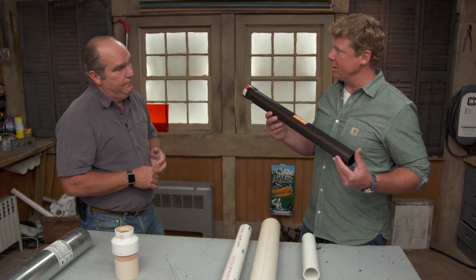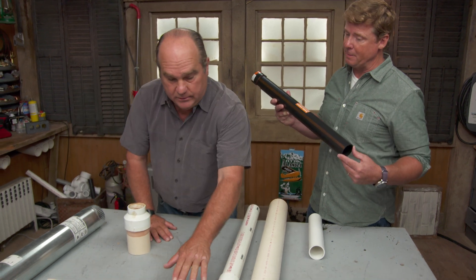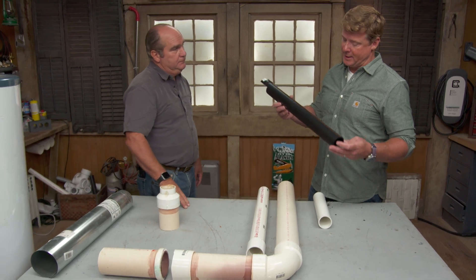So the lesson is, we're looking for this for new installation. If you see in your basement as a homeowner that the pipe is fully discolored, it might be time to have a pro come in and check it and find something that's a little safer. And as is always the case, a good CO detector is cheap insurance.